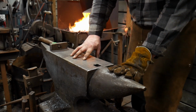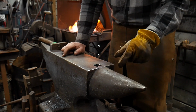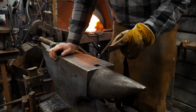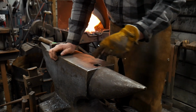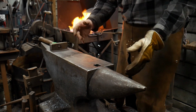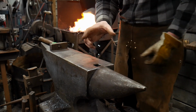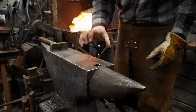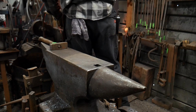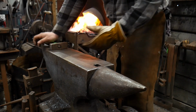This will bring me into another point. You can make one scroll jig, and a lot of times you can get away with using just one portion of that jig, as long as you didn't make it too big and open or too tight and small. So I can make scrolls as large as what this jig is, down to just as small as the first portion of that scroll jig, and get repeatability that way. So you don't necessarily have to make a new jig for every size scroll that you want.